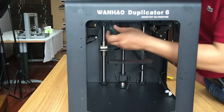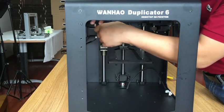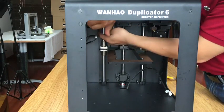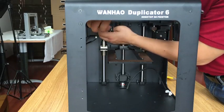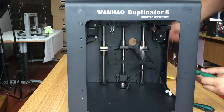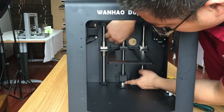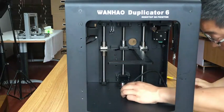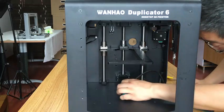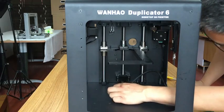You can keep the bolt there. Now the right rod locking system. Let's go to the lower one. Pay attention — you need to loosen this quick coupler first. Turn the screw so you can see the quick coupler locking bolt, then loosen it. For this one, you need a 1.5 millimeter hex wrench. Just loosen it and you can pull it up.